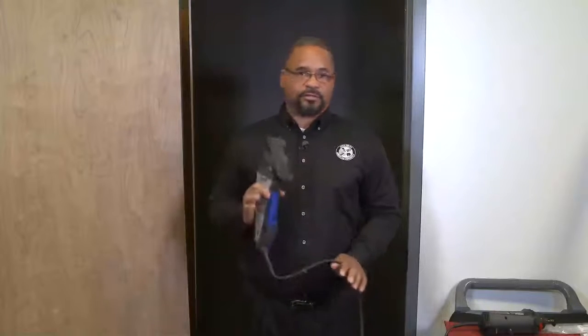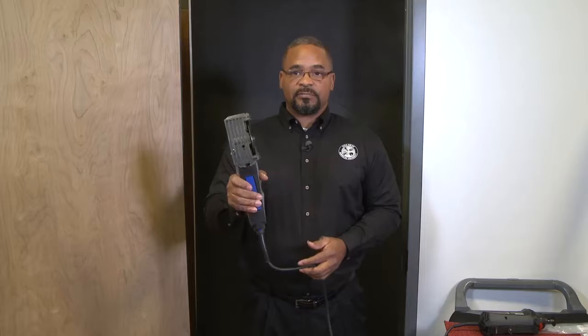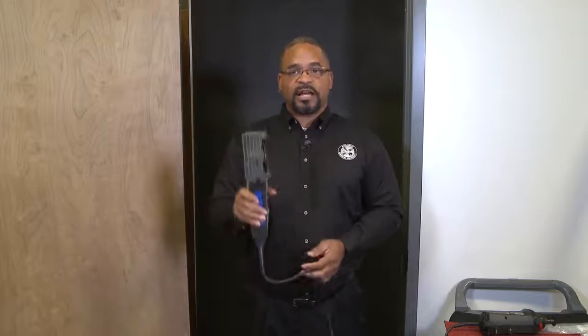First, we're going to talk about the actual cutting of the frame. Now, this is just my personal preference. It's not an endorsement of any kind for any tool over the other, just whatever your comfort level is. I've used quite a few tools to cut frames, and this is my personal preference. For doing the straight cuts on the frame, I prefer the Saw Max. It plunges the blade into the metal, and I'm able to move the blade up and down to make a very nice and straight cut.